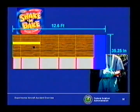Here's my diagram. The solid yellow line represents the length the spar actually protruded into the wing. The wing panel was 12 feet and only four feet of that actually encompassed a spar — the rest was without a spar. It had five or six ribs in it, and the blue area was actually an extension that had been added to the airplane at a later point and simply screwed to the tip of the wing.